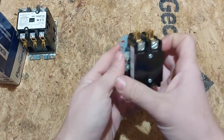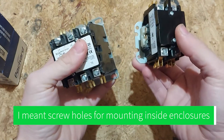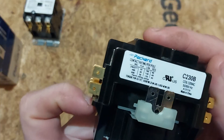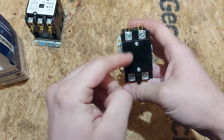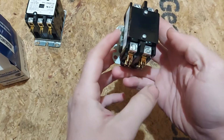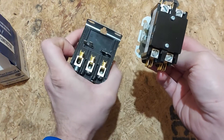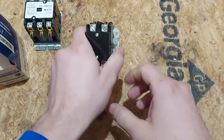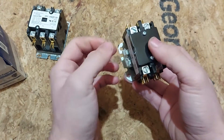Here's another example of a contactor. They usually come with nice screws so you can mount it into your enclosure box. This is a two-pole single-phase contactor, also a 120-volt coil, and it operates the same way. L1 and L2 on the line side, T1 and T2 on the load side. Once you energize this coil using the control terminals — sometimes they're on the side, sometimes on top — the power between these gets connected through the magnet. There's a coil in there and it will pull in when powered.